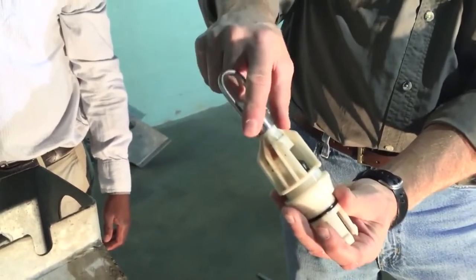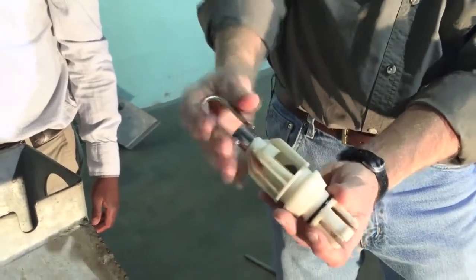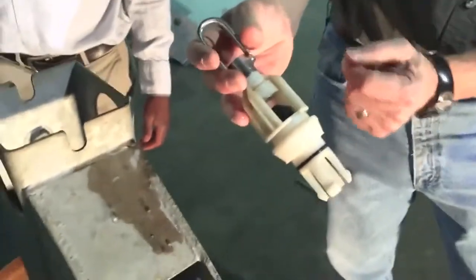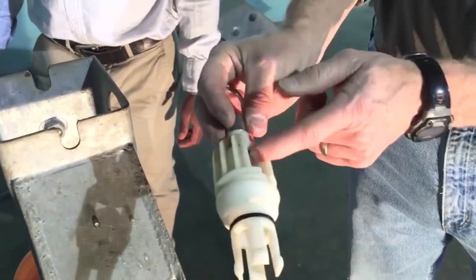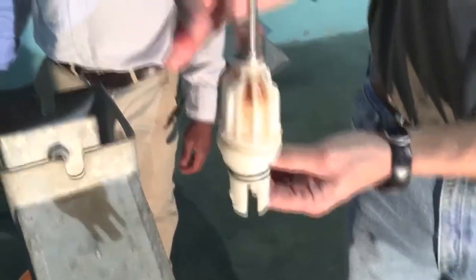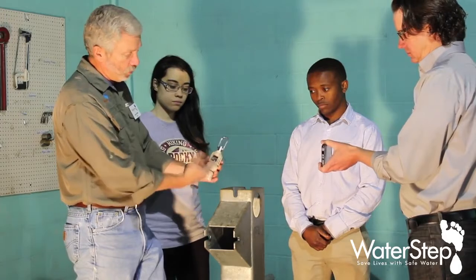That's why we didn't see that kind of tool on the top check valve — instead of a loop. Now we have the first of our sucker rods. When you purchase this in the store it comes with a cup seal, so if you want to use it as a top check you can remove that. Just screw your sucker rod to the bolt through here and it's a top check. Put the loop on, make sure your o-ring seal is here, and now it's a bottom check.